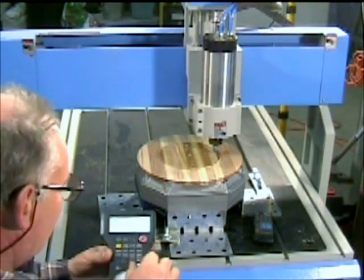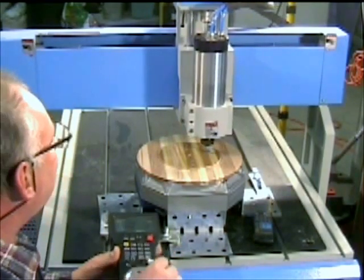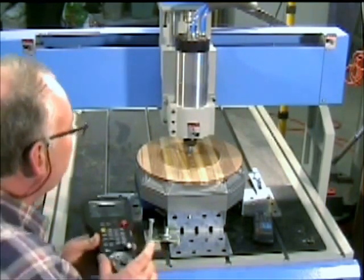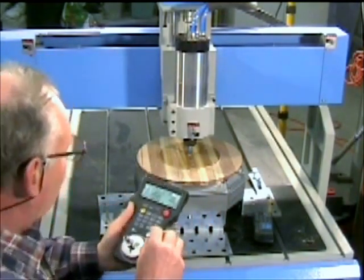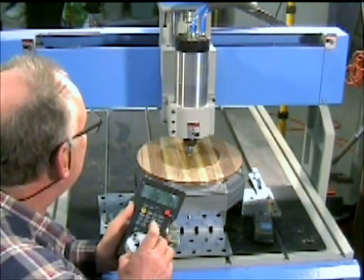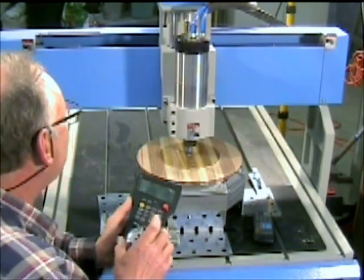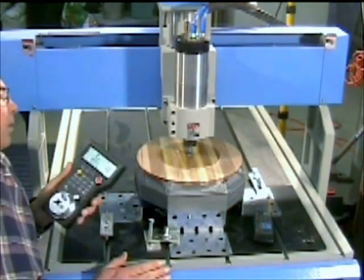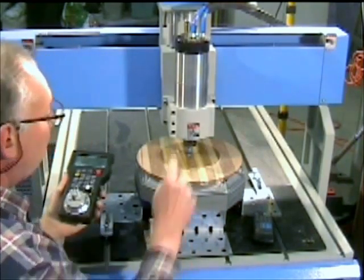Having said that, I hope I don't make a mistake now. Here we go — we'll just center this and zero it. I'm using a nice pointy tool there to give me a marker. Take it down a little bit, forward. Happy with that. Not only have I got a little pilot hole drilled from the center to indicate the center to me, I've actually got pencil lines on there giving me the center as well.